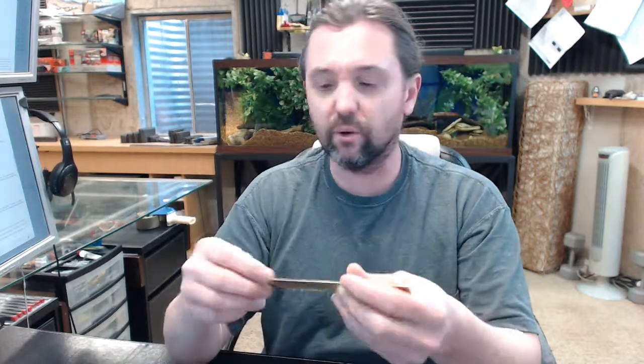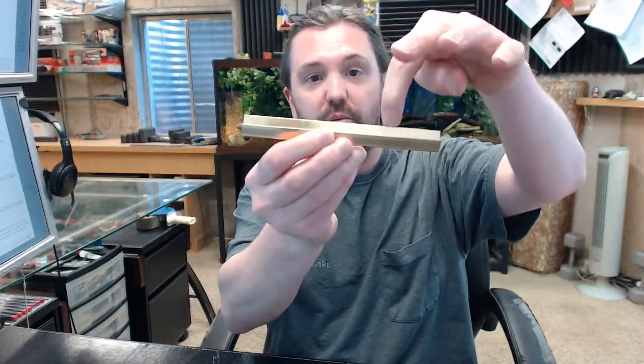The nails are sold per ounce. There are approximately 65 nails per ounce. The manufacturer recommends one nail every 1.5 inches, though my experience along with countless others would agree that that's far too close. But technically that's the recommended quantity. So whatever your center-to-center spacing is going to be — let's say 4 inches or whatever you elect to use — you're going to get 65 nails per ounce. They're sold in ounce multiples.